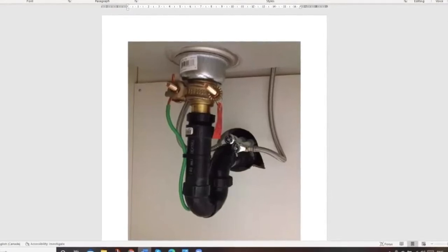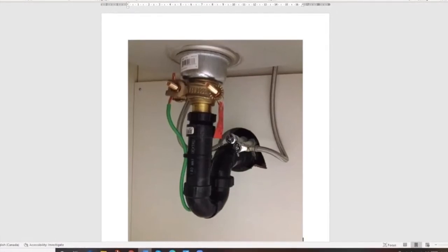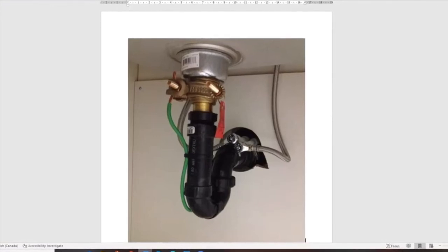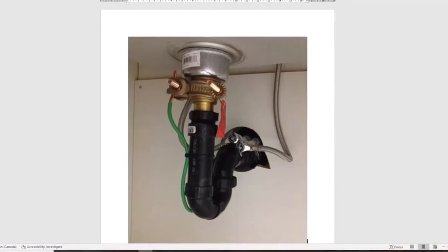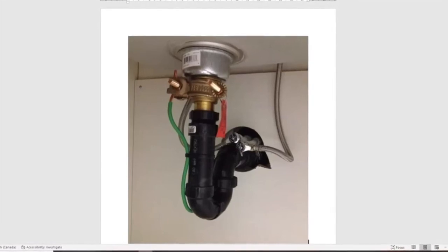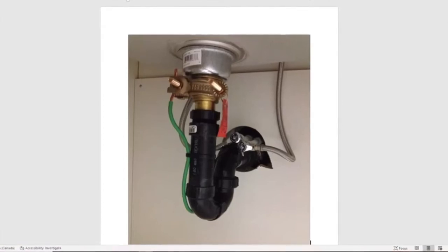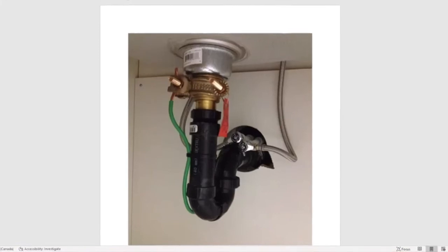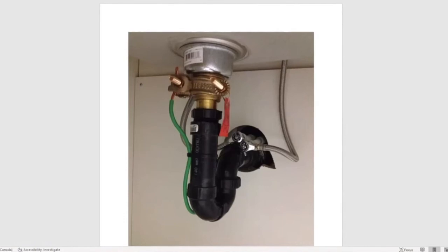Yeah. Well, now, what about if the water lines were metallic? I think if the water line's metallic, there's definitely a chance that sink could become energized through that copper metallic piping system. But that sink is isolated. I don't think it requires bonding. That's my take. Well, I agree with you 100%, Don, and thanks for chiming in on this.